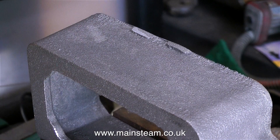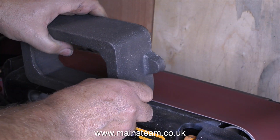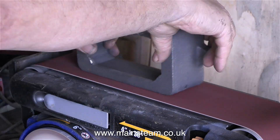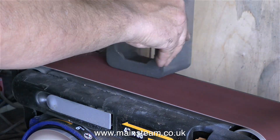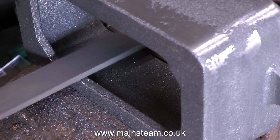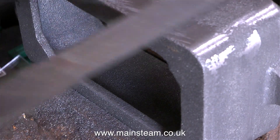On the outside of the box bed are two big lumps sticking out. I can use the file to remove these but it's going to take ages, and being generally quite lazy I'm going to use the linisher or belt sander for this. Once again you have to be very very careful not to remove chunks out of the box bed - I'm only removing these two protrusions. Once I'd cleanly removed the two lumps of metal, I reversed it in the vise and filed the other side - thankfully this wasn't chilled and it filed okay.